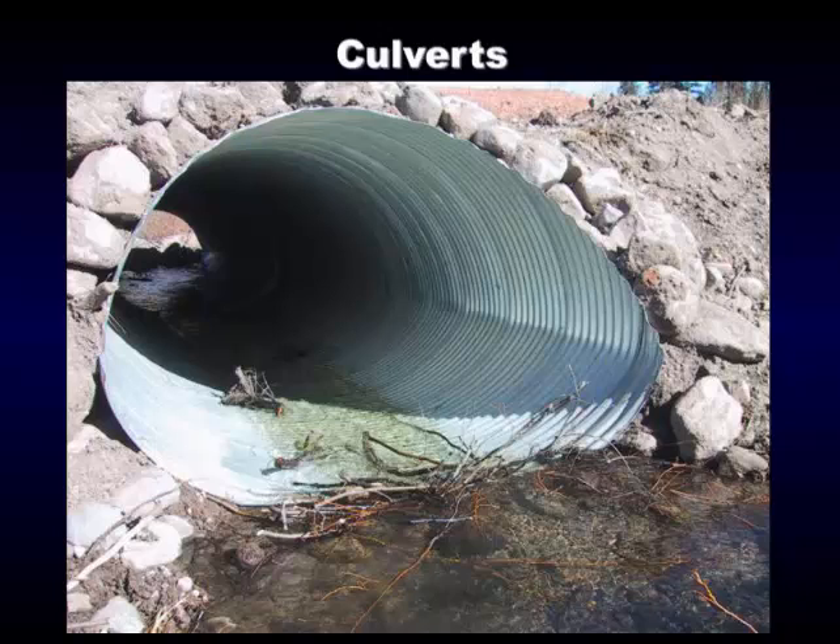We've got a high-quality fishing stream here. The state does come out and check for alteration permits on most of our timber sales. We had fish — a fish can only swim up a culvert at a burst of speed for so far before they give out, especially on a steep incline with high water velocity. The fisheries people said they want the culvert oversized by four inches and set right down in the stream so that eventually some silt comes in and the fish can swim up it without exhausting themselves. This is a Colorado cutthroat stream.